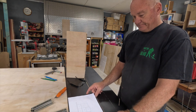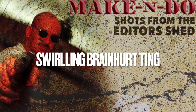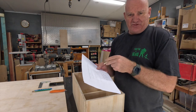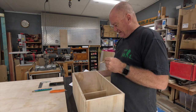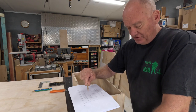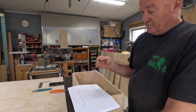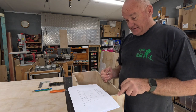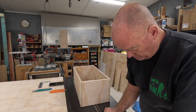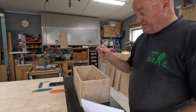I've done some thinking and some measuring and some calculations, and I'm reckoning the three drawers in the middle section are 191mm each. If they're even, 191 each, so that means the top drawer in this one is 191, which means the bottom drawer in this one is 285. I'll write that down — 285.